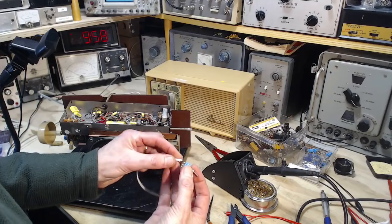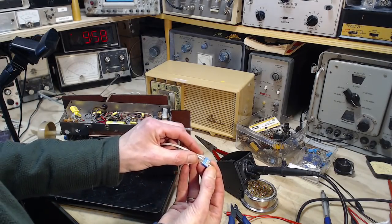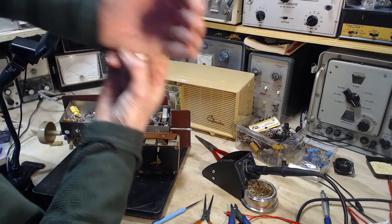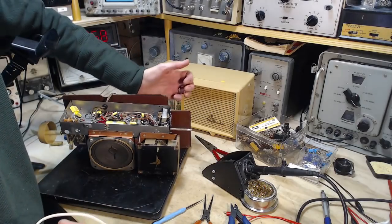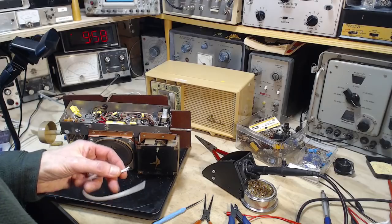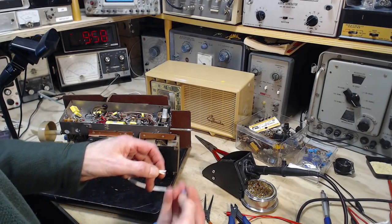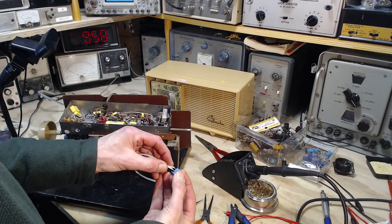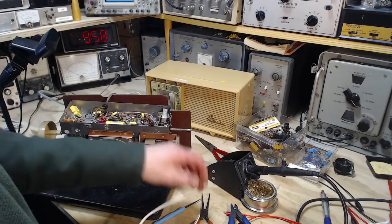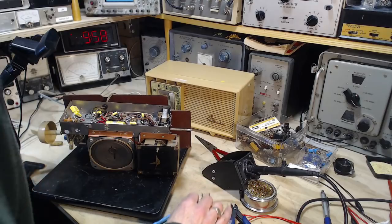Here's the switch I'm going to use. Put that on there, but you know, there's 120 volts sitting right there, and a person could conceivably reach around behind here somehow. Basically, you don't want that kind of voltage exposed. So I'm going to put on a shrink tube. Try to do a neat job connecting those and then shrink the tube up over them. That's my whole plan. There it is. Drill out a hole first.